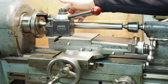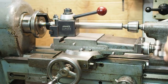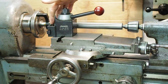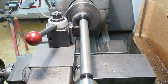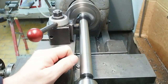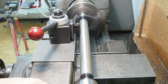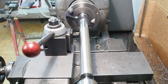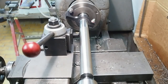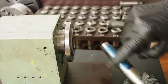Set up this way, I can turn the taper up to that lathe dog — it works with the normal top slide motion and I don't have to overhang the tool at all. Another advantage of the plastic lathe dog is it doesn't really matter if I hit it. I'll do a first fit-up and see how that taper is looking in the bore of the spindle. I'm going to use bluing and see how the fit is.